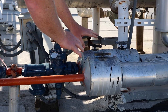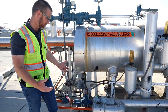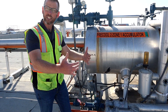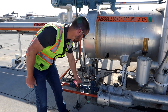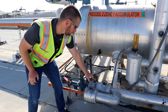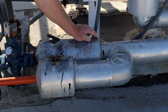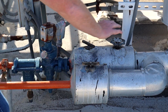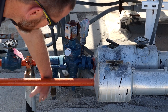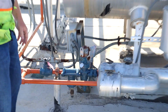Notice the next valve has a key handle — that's an indication it's a hand expansion valve. That is where our point of expansion is, changing our warm liquid ammonia into cold liquid ammonia. And then finally we have another isolation valve. So if you need to work on these valve groups, you can isolate and remove ammonia through the strainer to safely work on the valves.